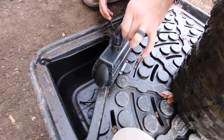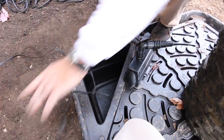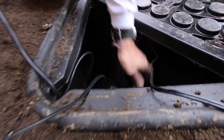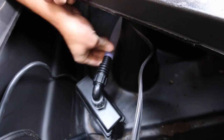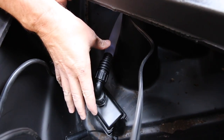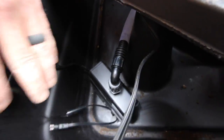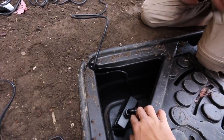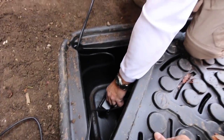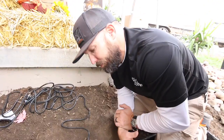The first question plumbers will ask: do I have to seal that with Teflon tape? No, you do not, because it's submerged. You can if you want to, but it's not needed. Just understand it's all hand tight. They give you gaskets — just like what's found inside a garden hose. This 90-degree elbow goes on just hand tight so we can turn it whichever way the plumbing line is going to go. This fitting connects to my plumbing line — I'm going to take that pipe you fed through and connect it. Keep it somewhat loose for now because we need it flexible once it gets down in there. So we hooked all the plumbing parts together, dropped the pump in, and fed the lighting wire out. Don't go Hercules on it — just hand tighten it, and don't forget the gaskets. Those gaskets also help prevent you from over-tightening.